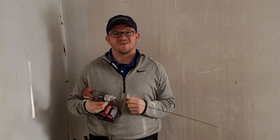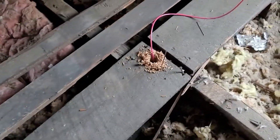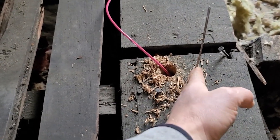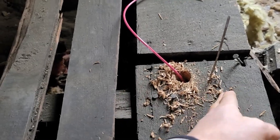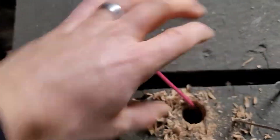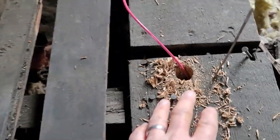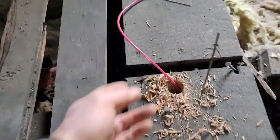We're up here in the attic now, and I want to show you what it looks like on the other end. The flag is going to come up just in front of the top plate. I go over two and a half inches — this is a six-inch wall — I go over two and a half inches and drill down. Down in there you'll see the wall plate. If you've got a two-by-four wall, measure over an inch and a half, drill straight down, and you're going to be inside the wall cavity.